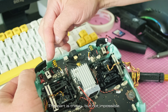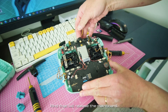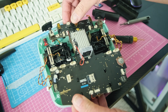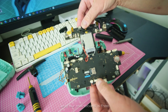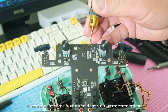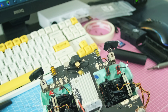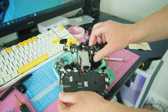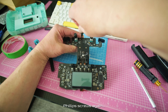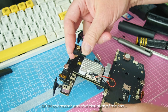This part is tricky, but not impossible. Very carefully, the top plastic wall should be gently lifted a millimeter or two, and that will release the mainboard. Gently move these wires that are in the way, and our mainboard is free. These are the screws which hold the SMA connector mount — I need to remove them, as well as the SMA connector and the mount.